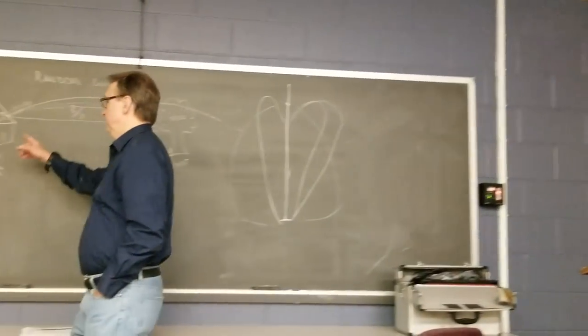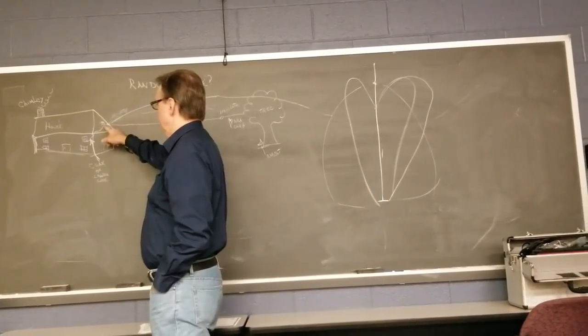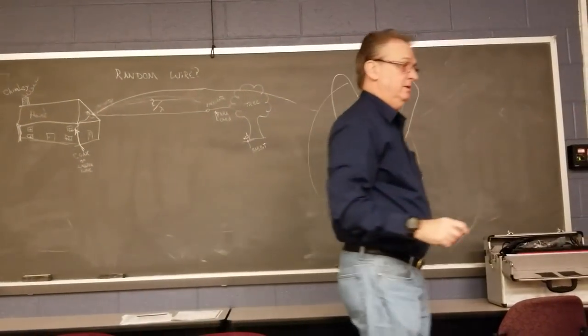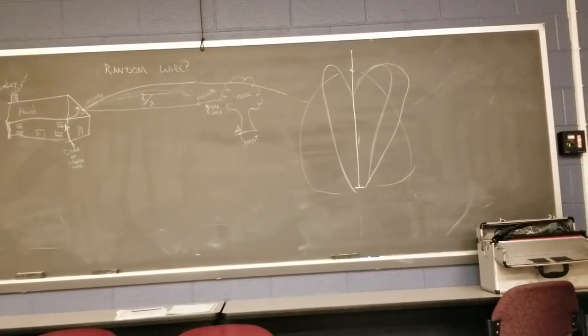And the house that I'm in is 1968 aluminum siding, and that whole house is a Faraday cage. So I grounded everything around the building, which probably I would not have had to, but I did. And I have the tuner on the gable of the house attached to the aluminum siding, and then I have another ground coming out of it too. But that whole house became the counterpoise, and because that tuner is out at the antenna, I don't have RF in the shack. The antenna tuner will only handle 120 watts, so I don't use a linear on it anyway. But that's how I did it.